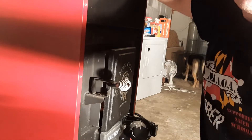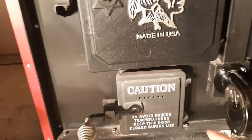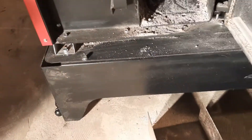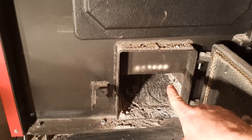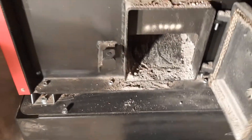I do have the fans going. Some of the things the manufacturer talks about: this is your ash pan, and the ash pan goes in here. Make sure when you buy this, you take the ash pan out. If you don't take it out, it doesn't draft correctly — so you need this open. In the center you can't see it now, but the grates in there let you push all your ashes down and they'll fall into the pan. I clean that out just once a day, real quick. It's important that you take this ash pan out — if you're looking at this furnace, take the ash pan out.